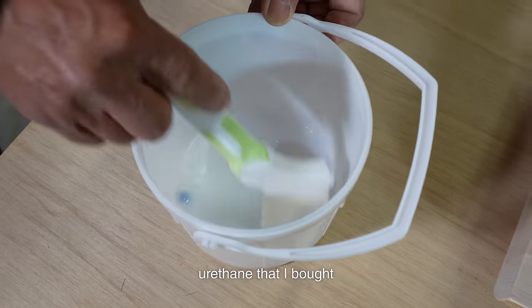However, this time the material has large knots. I filled the cracks here with quick-drying glue, but the knots are a problem. Your hands will be caught as they tear out from there. Oil can't prevent that. I asked the furniture maker and the painter what I should do to prevent it. They suggested I apply a urethane membrane over it.